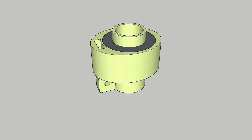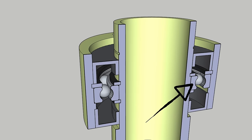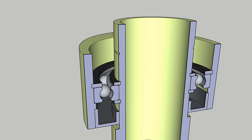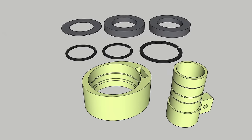Every furler is going to have two main rotating parts: this lower drum unit and then an upper swivel. Here you can see a cutaway of how the upper swivel is put together. There's just a single bearing in most of these parts, including the lower drums. Everything is held together with spring steel snap rings. The plan is to extract the accessible oil seal, remove the snap rings using the proper tools, then press or drive out the aluminum spindle, which will simultaneously push out the final oil seal. Then you can press or tap out the final bearing, and at that point we have everything down to parts and can assess the condition.